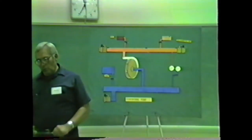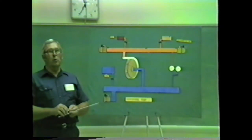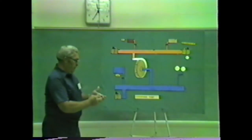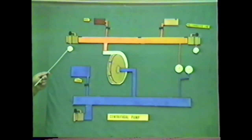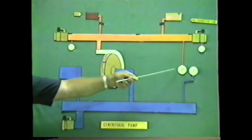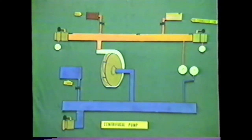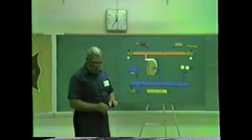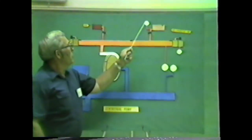We also have individual discharge gauges. Pumpers are now required to have an individual gauge on every outlet of two-and-a-half inches in diameter and larger. These individual discharge gauges must be plumbed on the outboard side of the valve, so the valve must be open before the gauge will read anything. If you put the gauge on the inboard side, it would read the same as the master gauge. On smaller openings such as pre-connected lines, individual gauges are not required, but many fire chiefs want them — in which case you plumb a gauge on the outboard side of that valve.